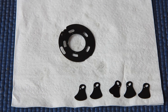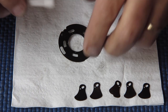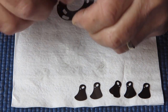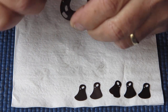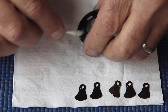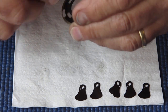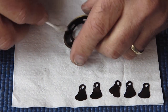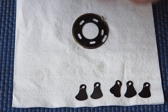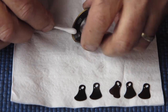And if you have grease over a wide flat surface area like that, it just sticks. The shear forces required to move it are just too high, given the weak springs that are intended to do the moving, and so they don't go. Well, that explains why the shutter was so reluctant to move, even though the blades themselves, though not entirely clean, were not in a bad state.